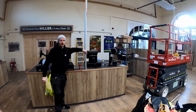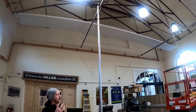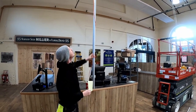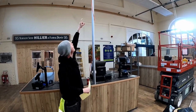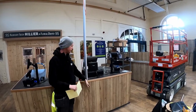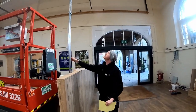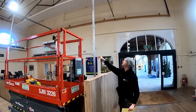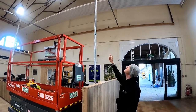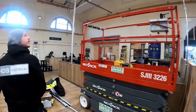Here we have our bonded pole. The company were supposed to be supplying four of these but they haven't, and they open on Monday. We've got separate containment for power and separate containment for data — both bonded, going underneath. Over here we've manufactured this from a couple of bits of conduit joined together, one for power and one for data going down to the tills. Once again it's going to be bonded.